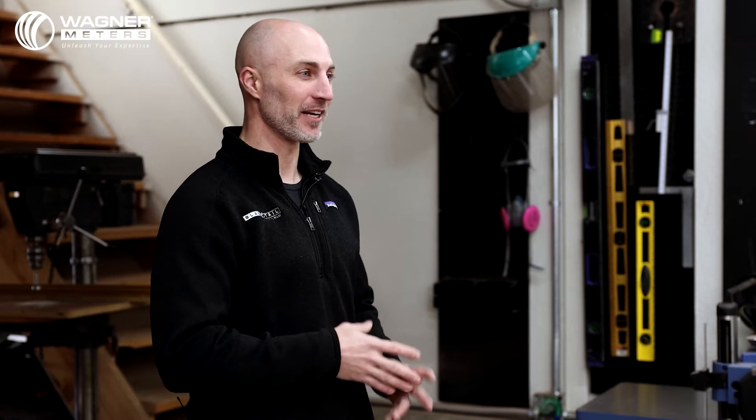The reason I started using the Wagner is because I found the wood supplier that I go to uses Wagner, and I tend to defer to the experts. If I didn't know anything about moisture meters, I asked Aaron what he uses. As I understand it, Wagner is kind of the industry standard — they use some handheld ones, but also big ones in their kilns. The Wagner being able to tell moisture down inside the wood is just critical for me, and also being able to trust it, because there are other ones out there that claim that, but they don't have the reputation that Wagner does.